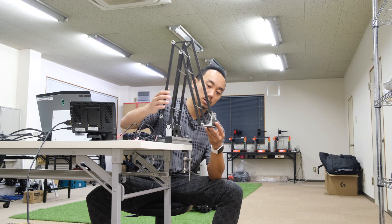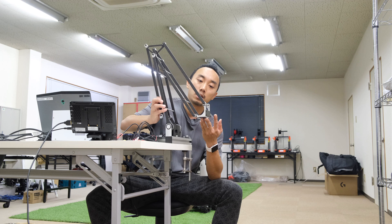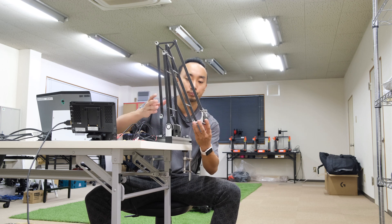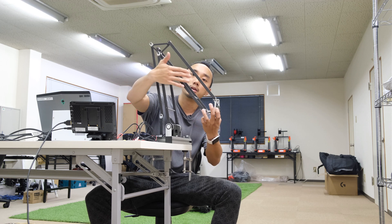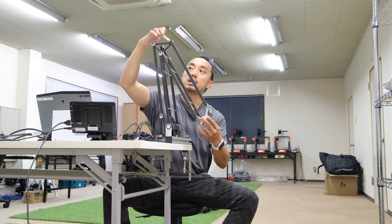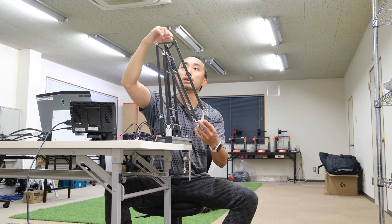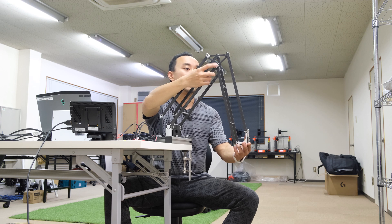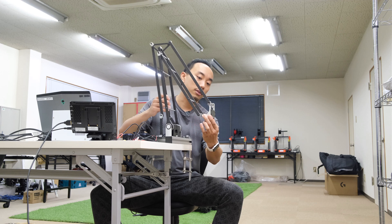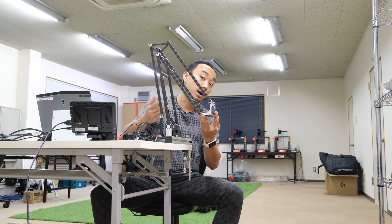You might wonder why not use a linear actuator for this kind of motion instead. This carbon part design is really simple to design and really easy to make, and it's quite lighter than a linear guide or linear ball screw. The robot arm itself is also pretty much faster than those actuators. As you can see, the overall design is pretty simple for a prototype. There is a little bit of wobbling in this direction because the carbon plate is quite long, and the passive joints are just simple bearings with M3 screws and nuts. But it's good enough to check the functionality of lifting the camera, and we can still upgrade the mechanical parts later.